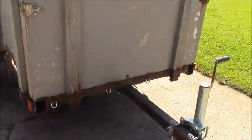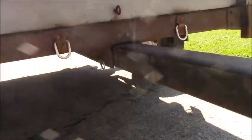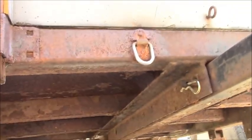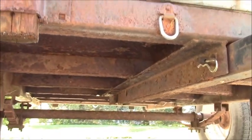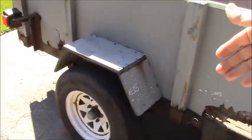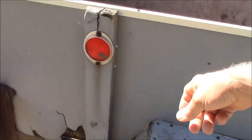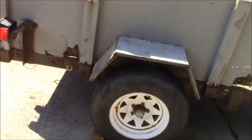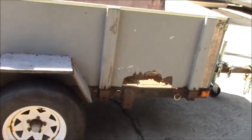It was designed to tilt. There is a hitch pin and the shaft goes back to a big 3/4 inch bolt we made with a grease fitting. I built the walls. This is MDO plywood, which is that plywood with the kraft paper and resin on it to make it waterproof. It lasted a long time. I'm going to use it again.